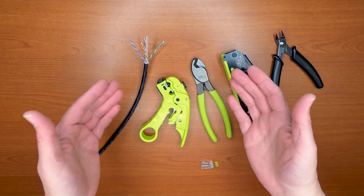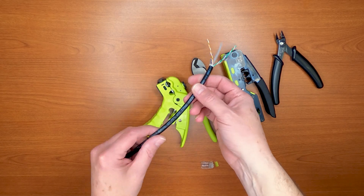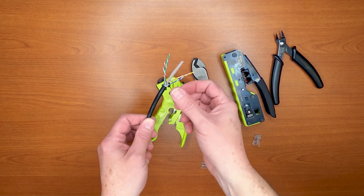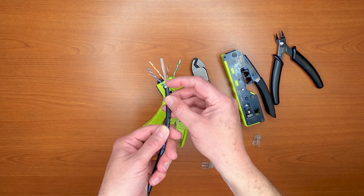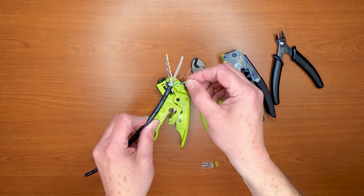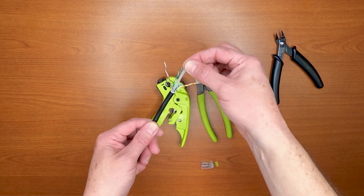What we've got here is our Category 6A unshielded direct burial cable. I've already taken the liberty of stripping off the cable jacket, removing the waterproof tape and PE wrap. What you're left with here is four color-coded pairs and a spline in the center.